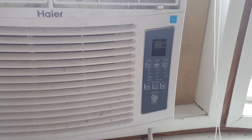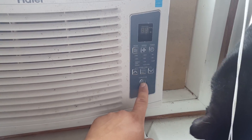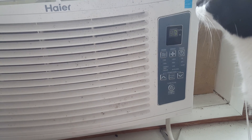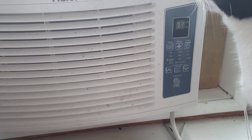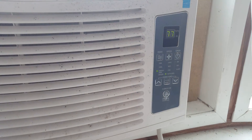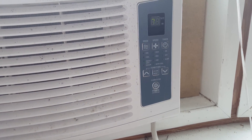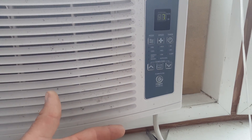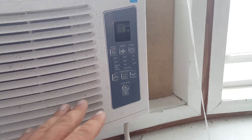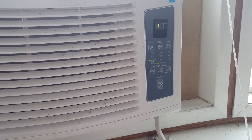The window air conditioner is plugged into the inverter. This is a big 12,000 BTU window air unit. The 5,000 watt inverter could not start this, so we'll see if the 8,000 watt inverter can. And it does not — the first attempt to start this failed. It has a power disconnect feature where if power goes out and comes back on, it'll automatically restart. Right now it's running in fan-only mode, and in a few minutes the compressor should kick on — but the inverter overloaded immediately.